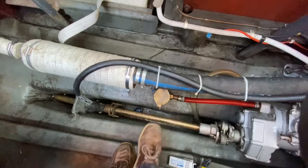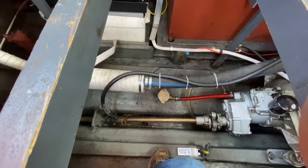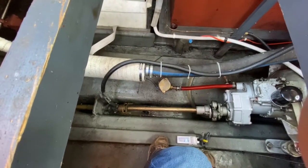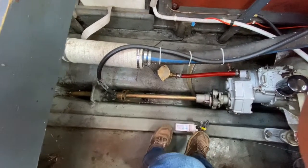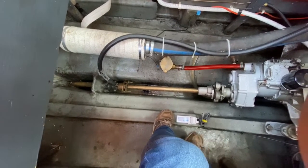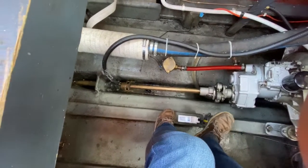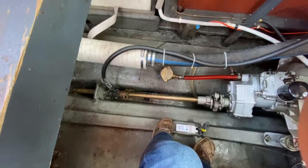So just quickly clamp down the little wing nuts, turn the seacock off, and then take it off and try again and you'll be absolutely fine. There are two ways of checking that you've done that properly. One is when you turn the seacock back on, as I've done now, there's no water weeping around the lid — if you hadn't got it all put back together properly, it would probably be weeping a little bit. To make sure the seacock is on and everything is working properly, as soon as you start the engine of the boat — and this is best practice whenever you start the engine — go and look at the exhaust and make sure there's water pumping through, and that will ensure that the cooling system is working as it should be.